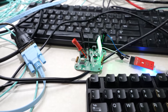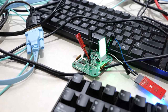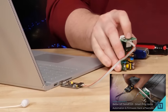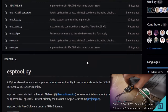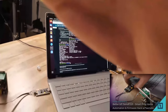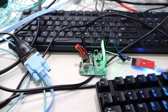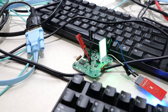For flashing the initial Tasmota, you're going to need a programmer. I'm using a simple FTDI programmer and programming it from Linux — no big deal. I've covered that in other videos. If you really need help, check out the Sonoff video for reflashing the outlet controller; the process is largely the same, and the firmware image is the same as well. Once you get the firmware set up, you pick this thing in a dropdown menu. Tasmota is so universal that you just flash the same image, and then in the web GUI Tasmota provides you, you say this is a 433 megahertz wireless bridge. There are also general-purpose IO pins here that you can repurpose for other things — that's a 200-level topic, so let's not worry about that for right now.